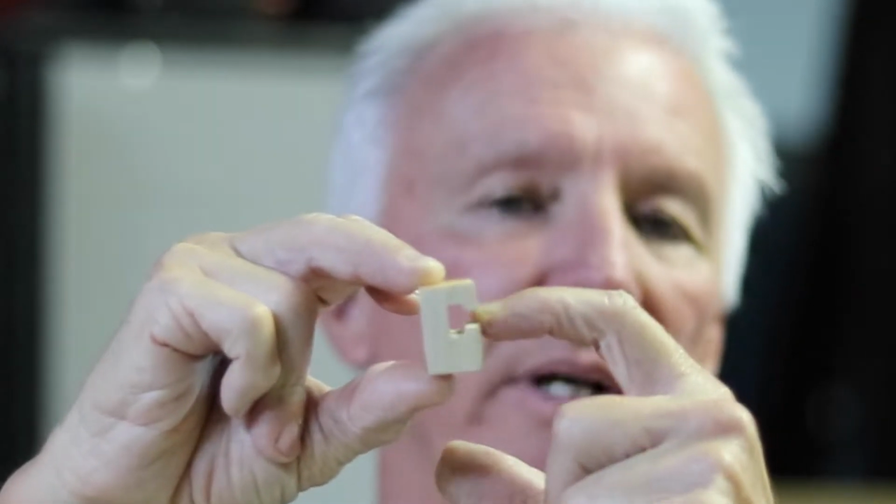I actually even have a little block that I give to the people I give these flags to, and it's the same depth as the keyway cut that I have on the back of my flag, so they put the screw in, slide this in, make sure it's set before they put the flag on. So one thing that I did is I would plunge cut and do the cut, shut the router off, slide it back out and pull it out, go to the next one.